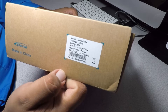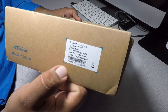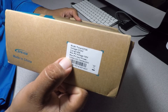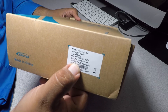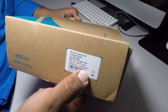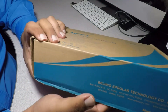Model: Tracer 4210A. Voltage: 12 and 24. Current: 40 amp. Max PV voltage: 100 volts. Max PV input power: 520 watts at a 12-volt battery bank, or you can do 1040 watts on a 24-volt battery bank. That's what those numbers mean.